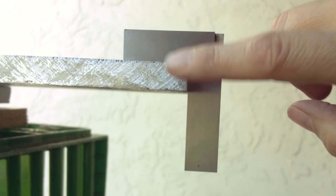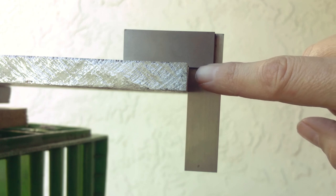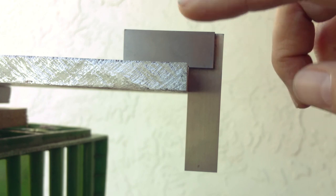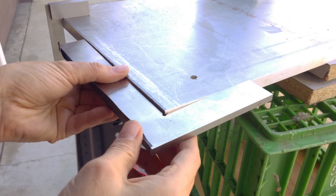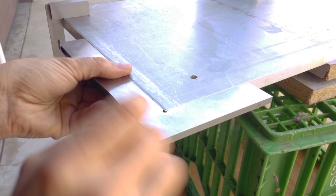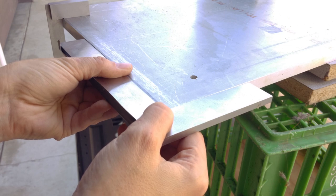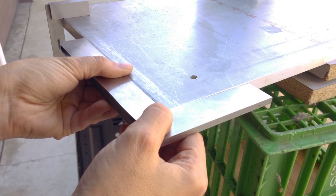This is just a raw edge, I'm not worried about that. You can see just a little bit of light at the top coming through, so this plate is tilting up while I'm sanding it. I brought the guard up just a bit and I think that will be okay. Putting a square to this edge - if I get it flush, I have just a hair of a gap right here. It's very tiny, about a third of a millimeter.